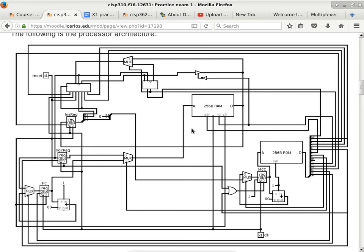Well, I wanted to explain it now because, first of all, I personally am fascinated by it, and two, I really think it's a good thing to explain, because it's made out of what, NAND 2 gates, right? But out of NAND 2 gates, you can make the smallest unit of memory, and I think that really is one, interesting, and two, it's a good way to apply what you learned about just logic gates.